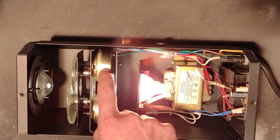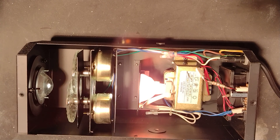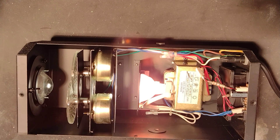So: transformer, lamp, two motors that run at 240 volts, the two discs interfere with each other, and then the lens and the output. I'm going to pause and remove this assembly so you can actually see these rotating discs better, because they are the secret behind its operation.